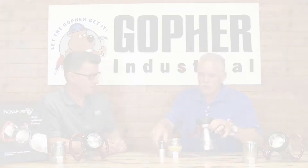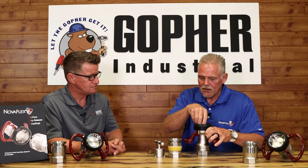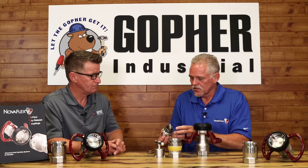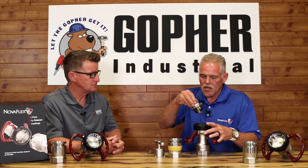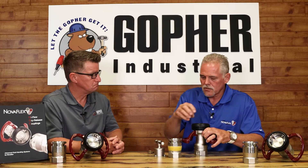All of the components are able to be sourced independently and can be taken apart and put back together, so if it's just one little piece, it's one little piece. A lot of places keep an extra set of the entire internals and just plug them in — take them out of a zip-lock, put the new ones in, and they're back in service. Take the old ones, put them in the zip-lock, and do the o-ring change in a clean area. In less than a minute you can be back in business — zero downtime.